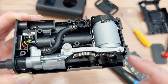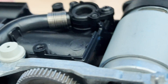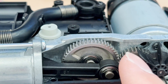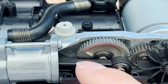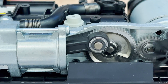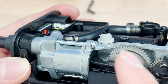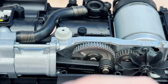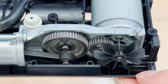Each of these gear wheels is of higher quality than usual — it looks like they're sintered metal powder gears. They have ball bearings in the middle, which is actually quite nice. There's a ball bearing on this one too. The crank arm is made of some form of plastic, which puts an upper limit on how high a temperature this can run at without failing. There's some balancing going on there, but no grease on these metal-on-metal gears — I don't know why. I might add some before putting it back together.